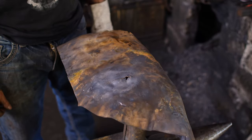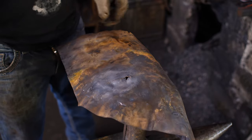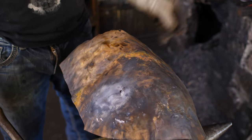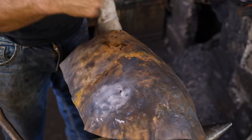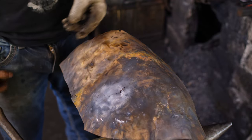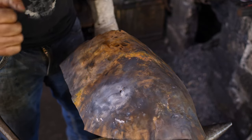When I was annealing the last time, I was not really paying attention. It only takes a second for this to get too hot and then it's just going to melt or burn away. As you can see here, this just formed a crack and that's it. At this early stage, I'm not going to try to work around and repair that. I'm just going to start out with another piece and save this piece - I will cut out other sections of it. But that is a cautionary tale for people looking to do this in a coal forge. You've got to be ever vigilant.